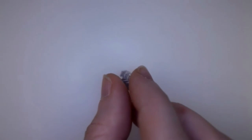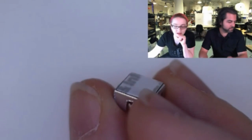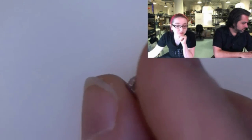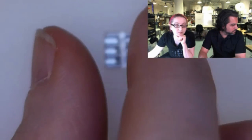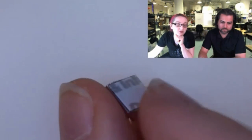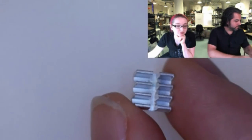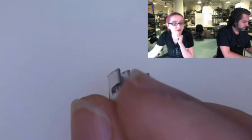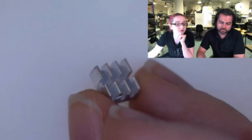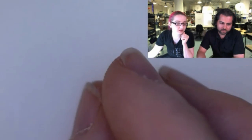It's such a teeny little heat sink, but this is really good for little QFNs and stuff. On the back there's a little bit of tape — this is 3M heat sink tape, so it's kind of handy. It comes in a pack of about 10 or so, and they're really inexpensive — just about 50 cents each. They're small, but if you need something that fits in a small box and you just need a little bit more thermal going on, you can stick them onto QFNs, QFPs, BGAs, pretty much anything. My friend Waz pointed out that it's easy to get big heat sinks, but it's really hard to get small heat sinks. As we're going into small motor drivers, they're so tiny you want to have a little heat sink to go with it.